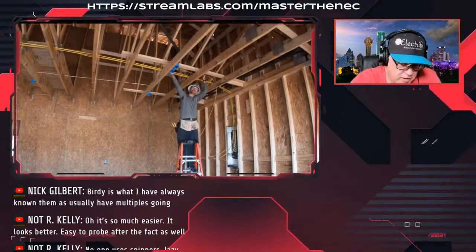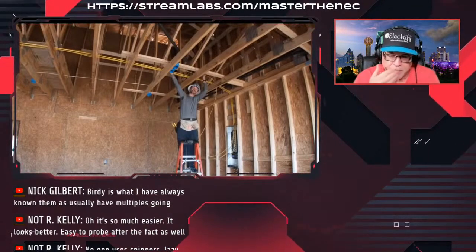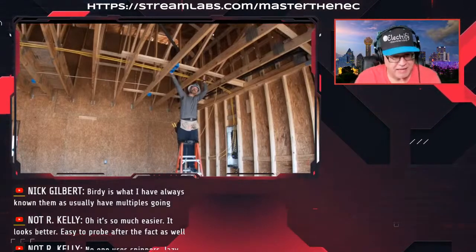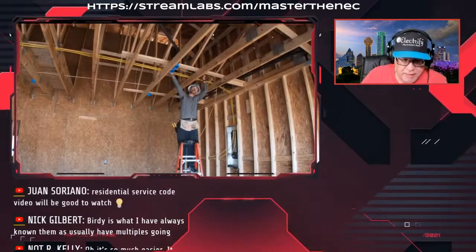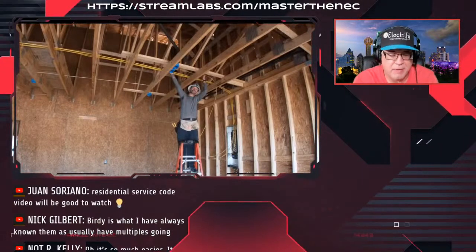Okay, just to FYI to everybody out there, this would be going to the dining room. So this is a small appliance branch circuit, okay? He's got the two that he's doing to serve the countertop. But again, the code says a minimum of two. He's adding an additional one. He's going to be picking up the dining room.